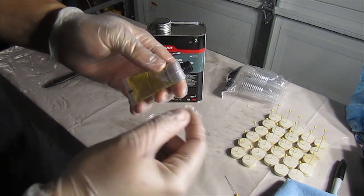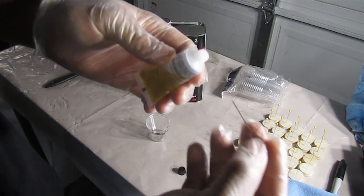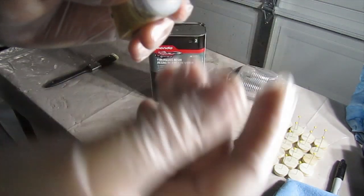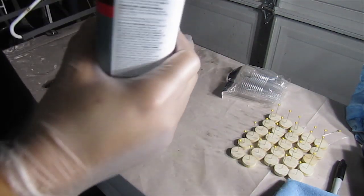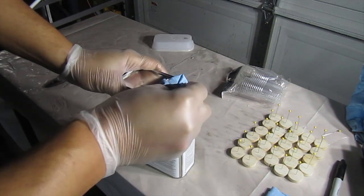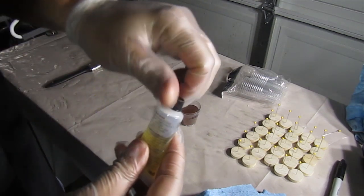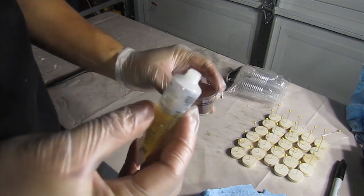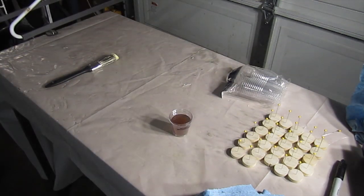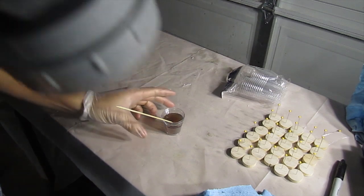This here, your liquid hardener, they are sealed. You're going to want to grab one of your quilting pins and puncture a hole right in the center here. This way you can get your drops into your fiberglass resin. Now we're going to pour our 1 ounce. Just make sure to try to keep everything clean at all times. Now we're going to add our liquid hardener. Remember, 10 drops. And now you're just going to mix it all up. Respirator on.